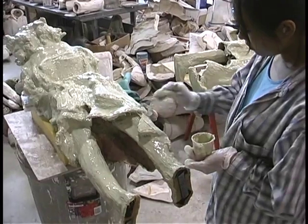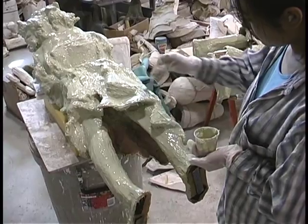Another popular way for artists to work is by using oil-based clay, which is very popular. By sculpting in oil-based clay first, the artist can return at multiple stages to add detail, add to it, or subtract from it. For a large piece, you could build a form first and then put the oil-based clay over it. After it is done, you would make a mold. Molds nowadays can be made out of a variety of materials; the most popular is rubber. The foundry applies the rubber mold in sections, built up to about a half inch to an inch thick.